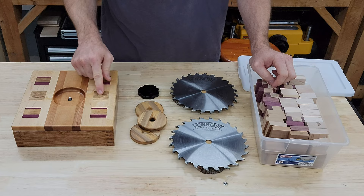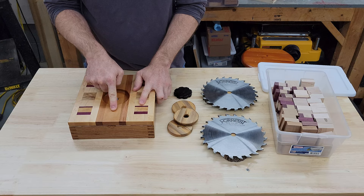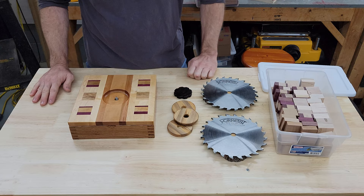I have some Purple Heart and Beech, a couple pieces of Chestnut Oak, some scrap maple left over from some picture frames, some older maple that's a slightly different color, and two pieces of Cherry. I glued all that together and let it sit for a couple of days because I wanted to make sure that the moisture level stabilized from the wood glue so that I didn't have any warping after I flattened the lid and put it in place.